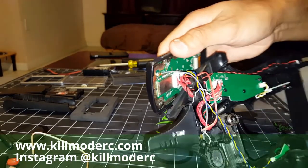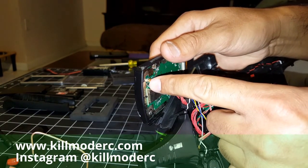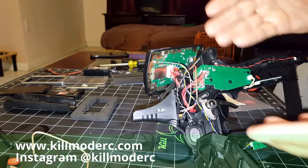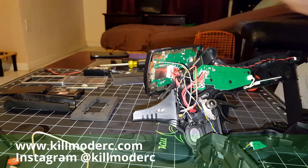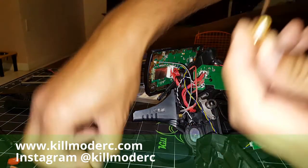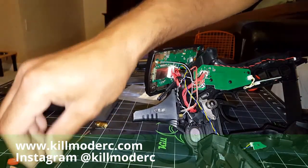Let me angle this so you can see it. You can actually see — so you know you've got the right cable — it says ANT there, that's your antenna. You'll have to figure out what your radio uses. I don't even know if all Flysky radios use that same cable, but I went ahead and figured it out and found the actual cable I need: the coaxial end on one side, and the little IPX plug on the other end. You'll have to figure it out for whichever radio you use, but I'm just giving you a general idea of how this works.